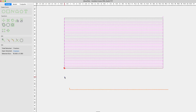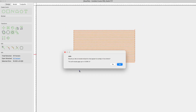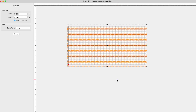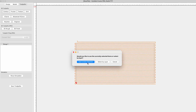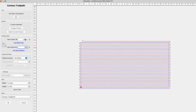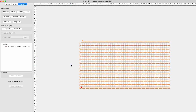As a final step, I'll add one more polyline to the bottom at the very beginning of my cut. Highlighting everything, use the Join Vectors tool and this will make those polylines into one continuous snake line that will face your board. You can resize it — pull it sideways without altering the step over, just adjusting the width. To add height, simply add more polylines and join them to the existing snake. This is a flexible pattern usable for other projects. From design, we head to toolpathing and utilize a single contour toolpath run at no offset. The maximum depth is set by the difference between the high and low points on our stock. With parameters set, we're ready to cut.